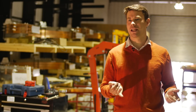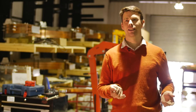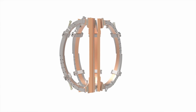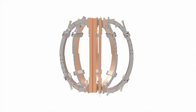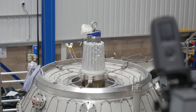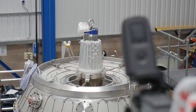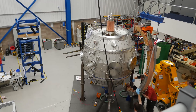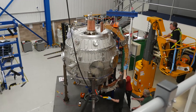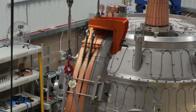It's the most important in fusion — you have to get high toroidal field to get high plasma performance. In the ST40 device, the toroidal field coil is made of a number of components: you've got 24 turns which are the outside part, and then you've got the centre column which is the part in the middle. When you're building the Tokamak you put the centre column in first, then bring all the limbs or arms of the toroidal field up around and bolt those on, and that creates the toroidal field coil.